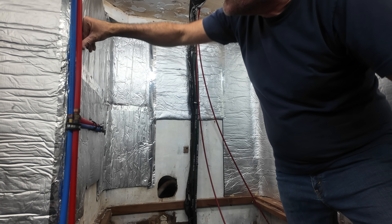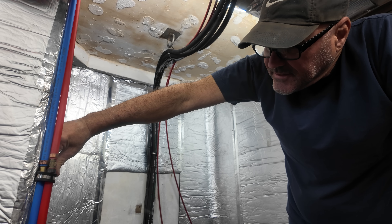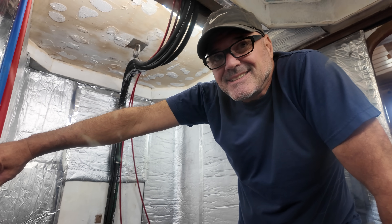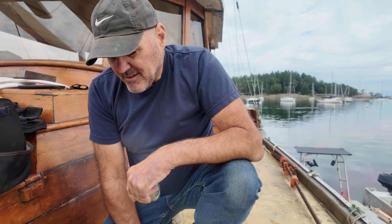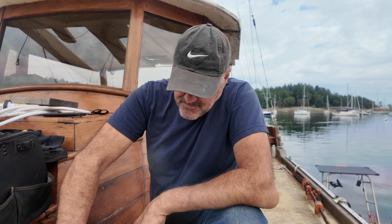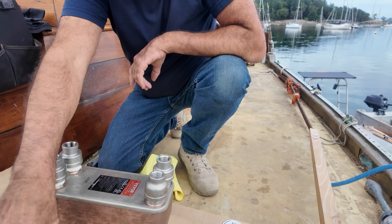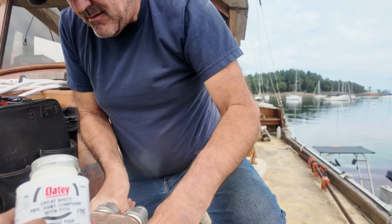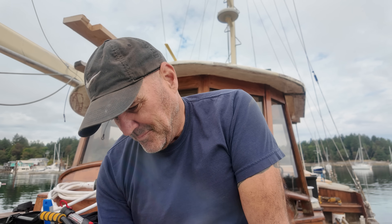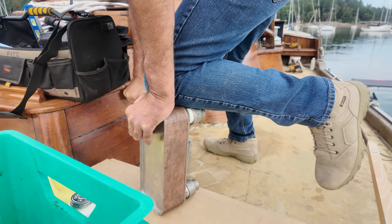So that's going to be on the main loop all the time. Now's the time to change it. Those fittings are very, very odd feeling. Those are from New Line, and this is from Vivore. So that's going to be the Vivore problem — it just feels like these are almost straight cut, and then these are NPT and tapered. And that's probably where the problems are coming from. To solve that problem, we're using Great White Pipe Joint Compound with PTFE — aka Pipe Dope. That's what the pipes are getting high on.